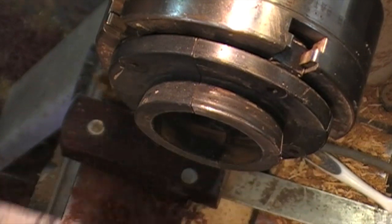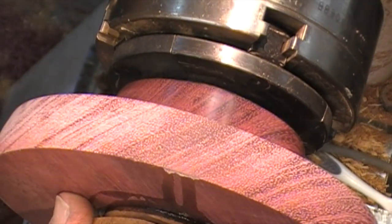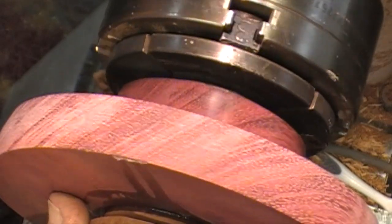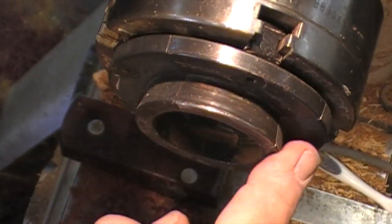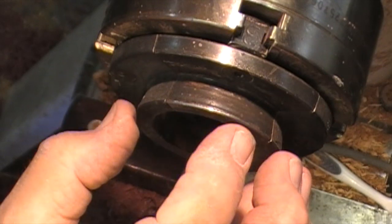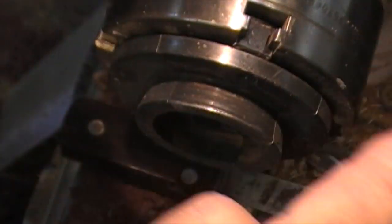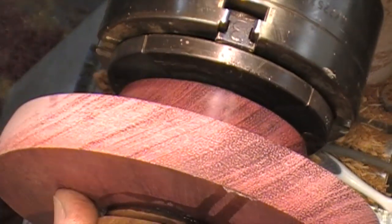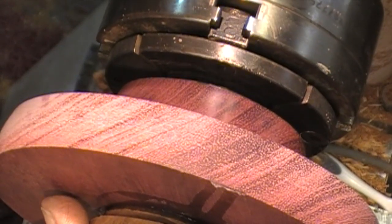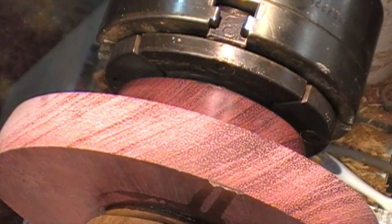That's why they were on this little chip — that would allow me to take this piece, put it on those jaws, and when I open the jaws, they open the minimum. Why the minimum? Because when this opens into something that's very close to a perfect circle, I get the maximum grab. If I opened it to something that was really weird, I'm only catching on points. So with that I put it in and open, and I just want to grab it — if I keep twisting on this wrench, I will break my bolt.